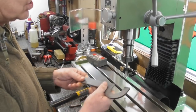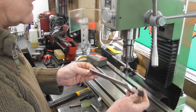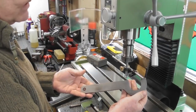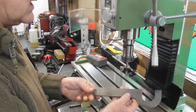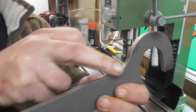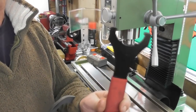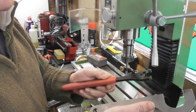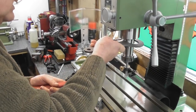I need to tighten up the collet chuck. This spanner came with the machine — it looks like it's been plasma cut; I can see a flame-cut finish on there, absolutely no attempt to deburr it, all the outer edges are sharp. So a little bit of hand fitting is going to be done on that. The spanner I've got for my collet has got broken edges and a nice rubberized handle — it would have been nice if this one was of similar design, but I'm sure I can dress it up.